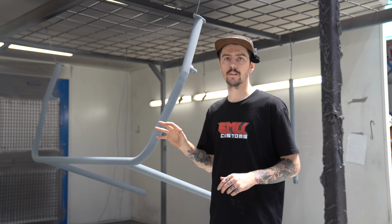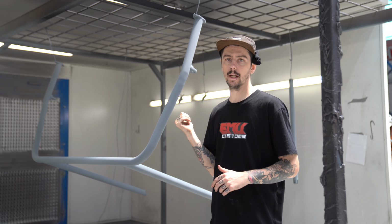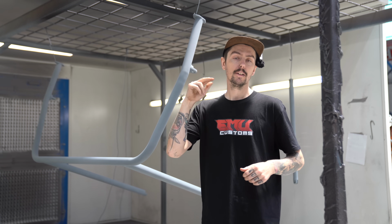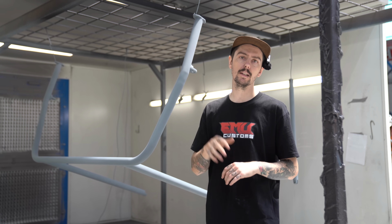We've just applied some primer to the bar work here. As soon as the tray comes out, we'll be able to get that in primer and then get this and the tray in there to bake that primer, out again to do the top coat and then back in for a final time. So we'll get to see what that canopy looks like in a minute.